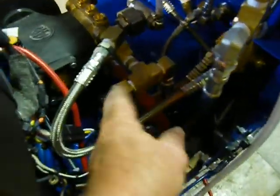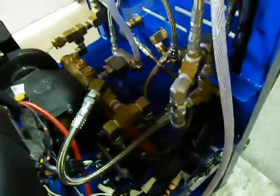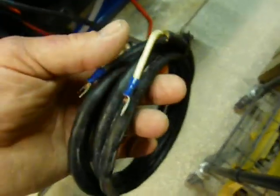We also have dual pulse hoses to help smooth out your spray. When you get displacement from your high output plungers, this will absorb the energy, smooth it out, and take the wear and tear off your hoses, fittings, and coils. You also have your inline filter here for your chemical bucket, and connections for both the thermal line with wire connects, which goes straight to your terminal block on your recovery tank. This is your high limit shut down so you don't run your water too high.